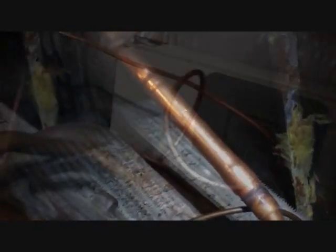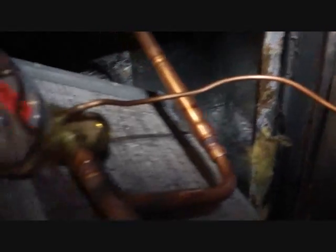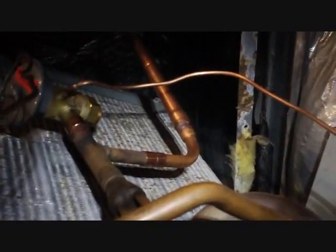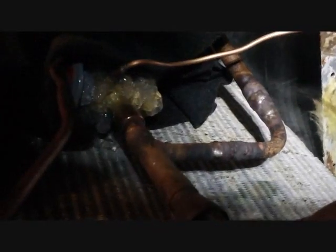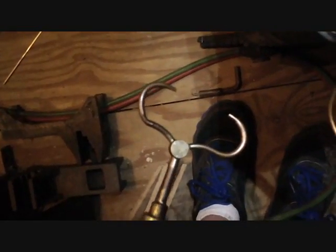Since we're doing a TXV replacement, it's so inexpensive to replace the little screen in there — we'll go ahead and replace it since we're right here and it takes about two extra minutes. Got our check valve assembly fitted up. The equalizing tube is placed in there — I sweat the other one out. Everything's placed, so we'll get the whole shebang put in place and we are ready to braze. Most of our joints are brazed. I laid the cool gel on the TXV to keep it safe while brazing — it should only take a few seconds but I don't like to risk anything. Got access points here so I can test this coil — I'm not about to put the air handler back together if the coil is leaking. The TXV is being a little hard to braze because I have to get underneath it and all the copper pipes around it make it difficult. So I'm gonna break out the devil horns torch and take it down.